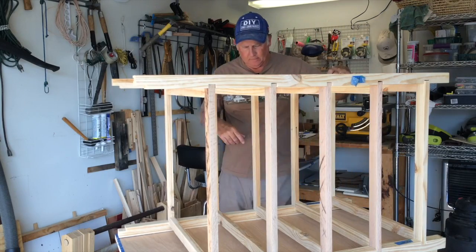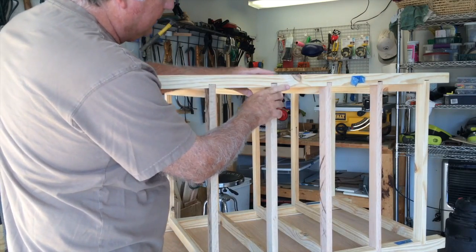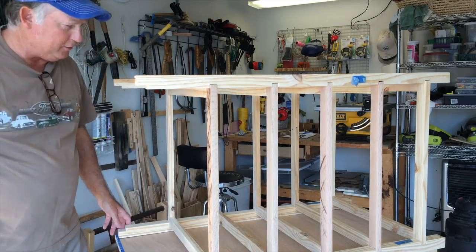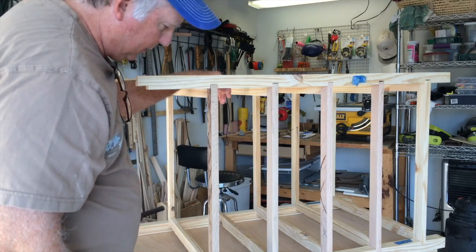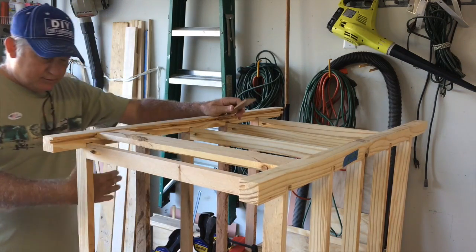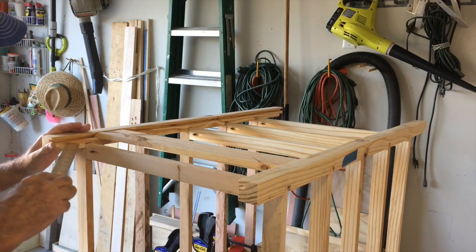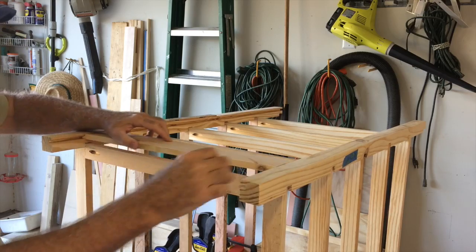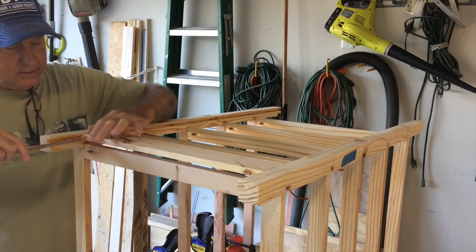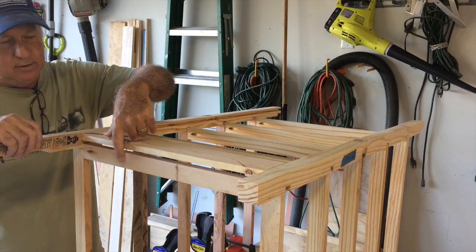I recognize the challenge — getting all of the drawer box slides flush with this front piece here. I'll have to do a little fine tuning, maybe with the help of a couple of clamps to figure it out. Here we are with our dry fit. This is the side piece over here, and this is the front where the drawers will slide in and out. We need to understand that these little dados will have pieces sliding in here, and we want this side piece to stop at about 3 and a quarter inches — just a smidge past that last drawer slide box.